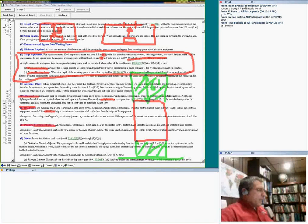So you can bring in your equipment, but you can't put anything foreign in this area. Nothing foreign can enter this area. So you can't put a big duct right in this area, especially at the top. It is dedicated space. A suspended ceiling, guys, you can put in, no problem. A foreign sprinkler system coming to sprinkle the switch, believe it or not, that's okay. That's not a big deal.